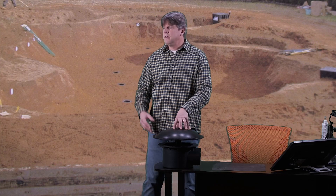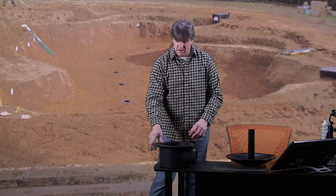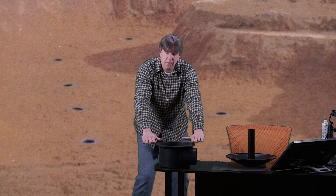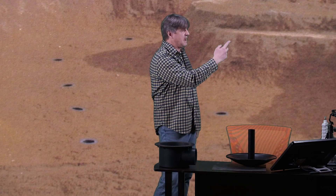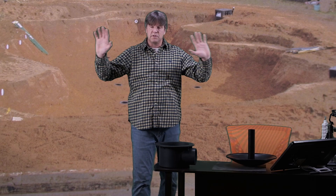Once the bottom drain is set, we backfill all the trenches, fill everything up, rake it all out, and pack the dirt nice and tight. We rake out the bottom to make sure we have a nice slight slope right down to the lowest point at the center where the drain is, so all sediment comes down, hits the liner, and works its way right to the drain and out. Keep the sides of your pond with a slight angle — we don't want straight walls with a flat bottom. Everything should curve nicely, and that curve also helps support the sidewalls because the water pressure helps hold them.